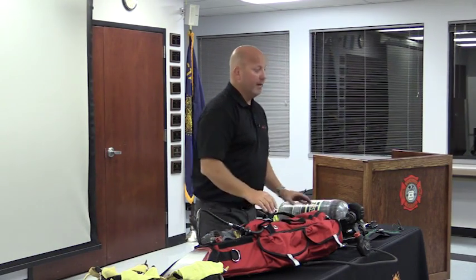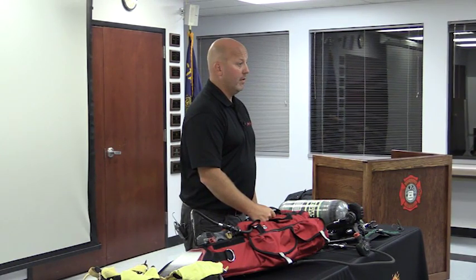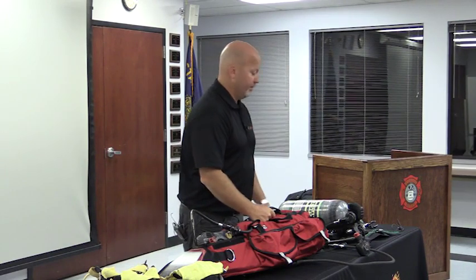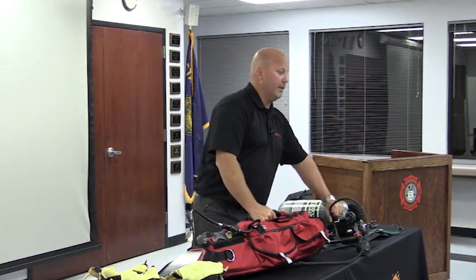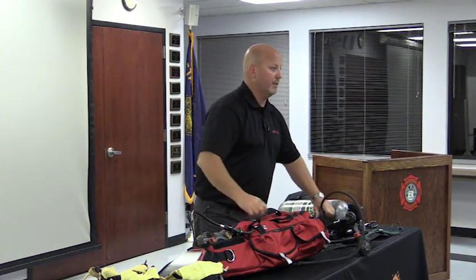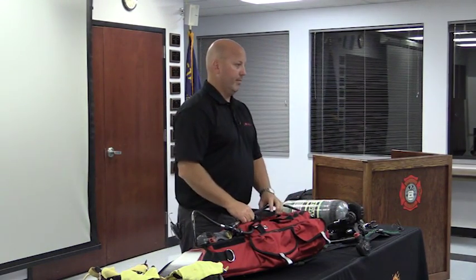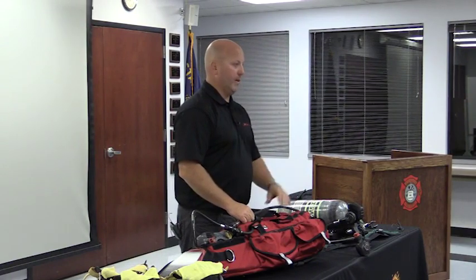But you follow me. Right now we don't have the ability, or did we end up with a hose from air pack to air pack? No, we don't have that. Okay, I do understand the answer. Because you can't stay connected to somebody and change that cylinder. If the line's pressurized, you can't break the seal at the coupling nut. Right. And I also can't bring in the air pack off of the truck, because you have no way to connect into it.